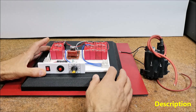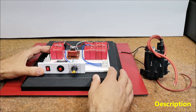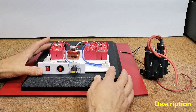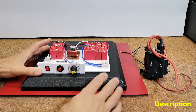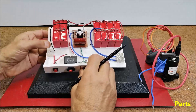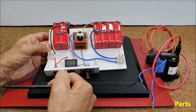One of the most important features is also the possibility of long-term operation. Of course this design also has negative features — primarily the offline mode of operation, which means that the mains voltage network is used directly, as well as the low oscillator frequency which is limited to a few kilohertz due to the semiconductors used, and thus the efficiency when transforming the voltage is reduced.